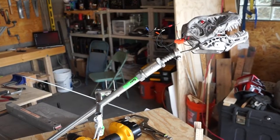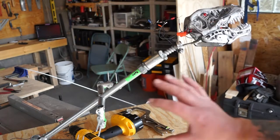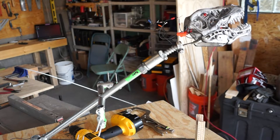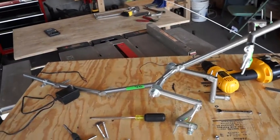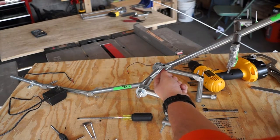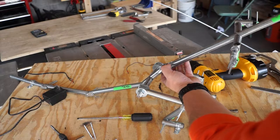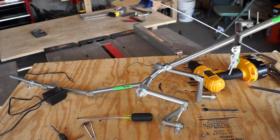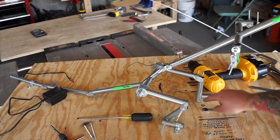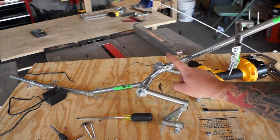All in all, it looks like without a whole lot more work, we've figured out that we can get Rex to take a more vertical body angle. How did we do that? We went ahead and tinkered with this single joint in the spine. And the only thing that's changed here is the size of the threaded rod that we're using to hold this joint together. So, what this gives us a really good indication of is that if we want to make Rex's other joints self-supporting, we're going to have to increase the size to at least 1/4-20 and go from there.